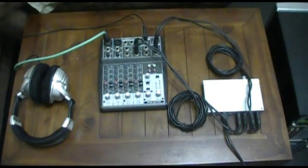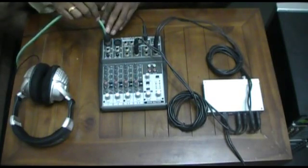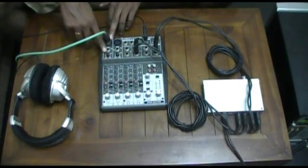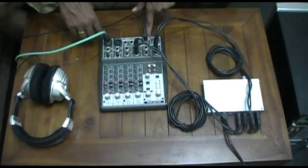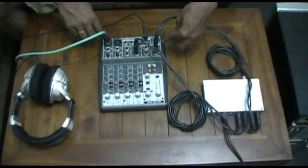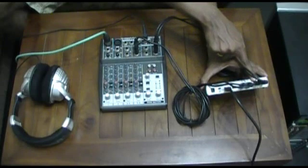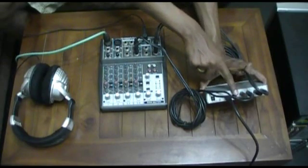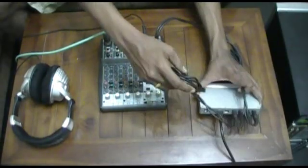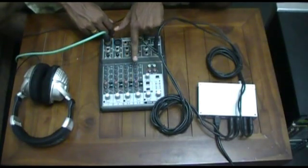I'm going to go through this one more time about what we have done here. We have plugged our mic input to the mic input port right here — this is the first channel — and we have plugged our headset here. We have plugged our main output from the mixer, the main out, right into the firewire interface unbalanced input. The other port from the firewire interface, the unbalanced output, we have plugged into the fifth and sixth channel of the mixer.